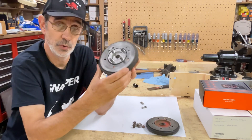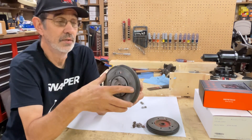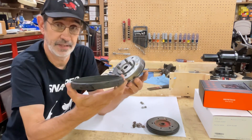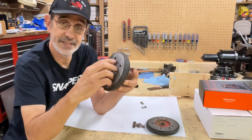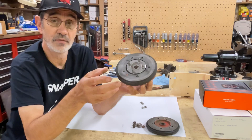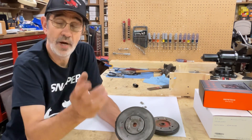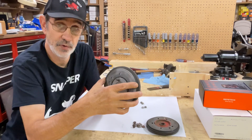How these are intended to work: when you let your clutch out, no matter if you do it slow or fast, this is going to swing into your drive disc and get pinched between your drive disc and your clutch disc assembly. This is going to slowly start turning, which is going to turn this in the chain case and make your machine move. Now if your machine stops moving, moves slow, or won't climb a hill, watch video number 70 and tighten the yoke spring — that is what pulls this into the drive disc.